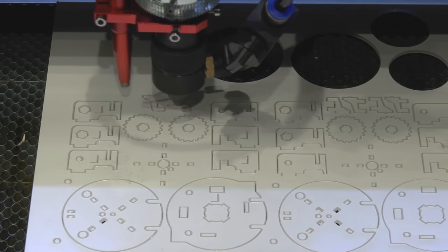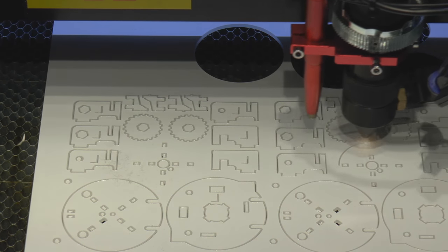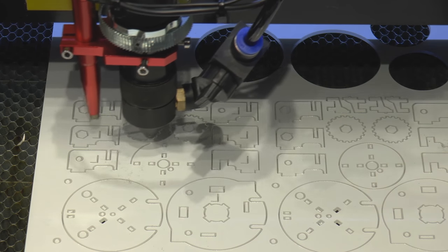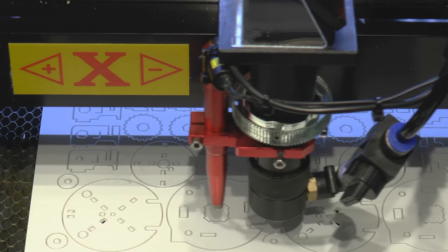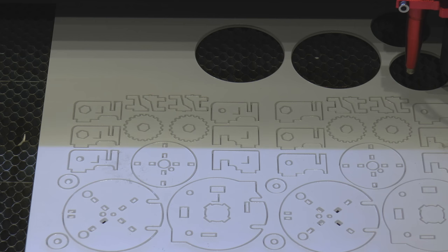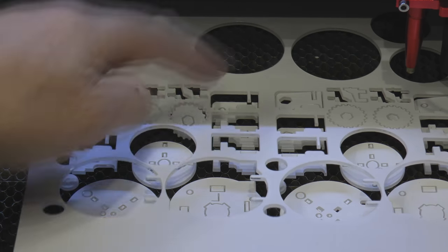Right, now even though I'm using two gold mirrors on here, which have lost me about 10% of the power, and this tube is not the most powerful tube in the world, I'm using a 1.5 inch lens that I've made, and it's still doing a pretty good job of cutting this 2mm acrylic. I'm cutting it at about 20mm a second, and I'm using maximum power, which is about 55 watts. So with a bit of luck, you will see that when I lift the pieces out, they will all stay behind, give or take